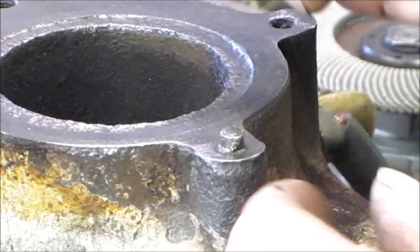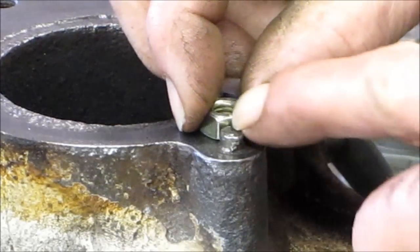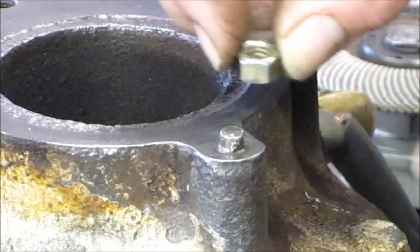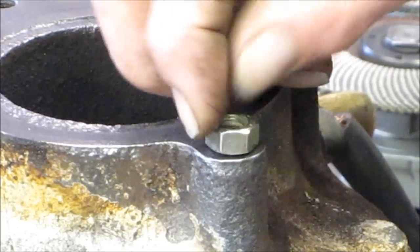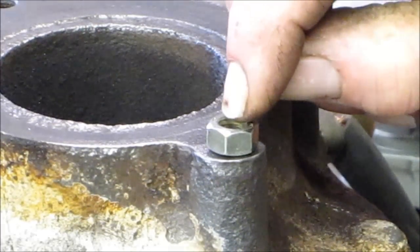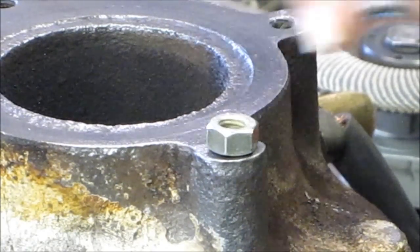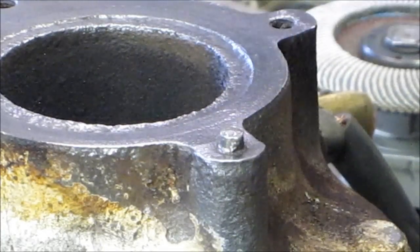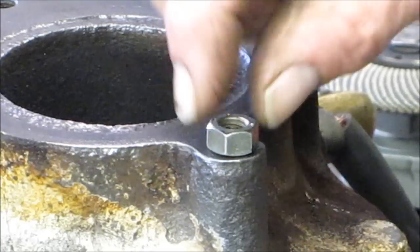Now this is kind of a slight debate there. That is a little bit better than halfway through this nut sticking up. And it is nice and square on the top. And I got it nice and clean all around there. And I believe that's going to be strong enough. And I'm going to very carefully come in here and weld into that, make sure that I got a good bond on there, fill that gap back up there, rather than try to build a little bit more on here right now and then try to get the nut down over that, because we are pretty close to the diameters there.